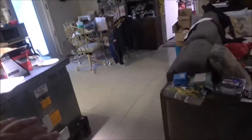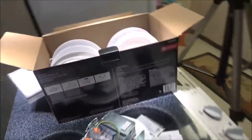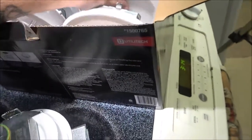That way you walk in, you can flip the light on, because remember the bar is going to be even with this, so the bar is going to come out to about right here. So you got to walk clear around and back there. And if you're coming in at night carrying groceries, you will have to walk clear around the bar, and over there and turn the light on. It doesn't make sense. So we're going to put the switch right here. You come in, flip the switch on, and it is going to be on a dimmer, so we'll be able to dim the stuff to film and whatnot.